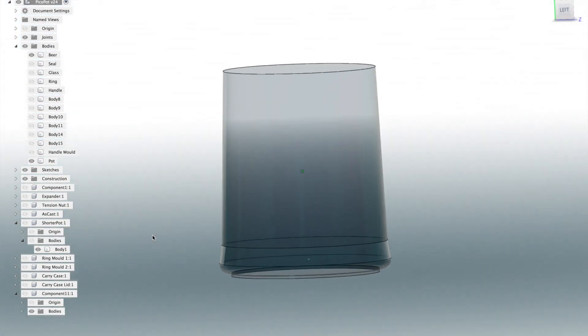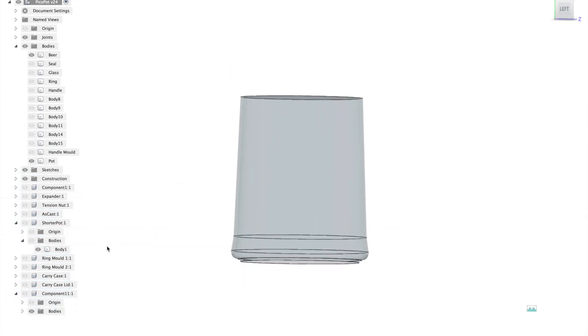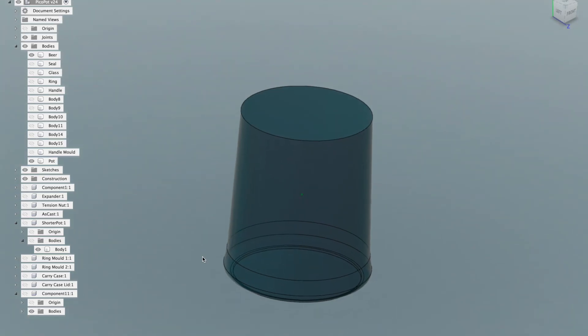This is a model of the drink inside the tankard, and as the tankard is smaller at the top than at the base, but there needs to be a flange for the glass bottom to seal against, the inside of the mould has to be an awkward re-entrant shape. This means that the mould is a little more complicated than it might be expected.